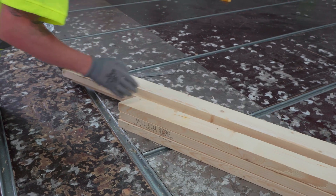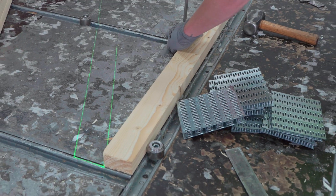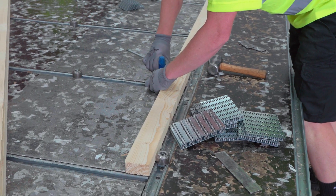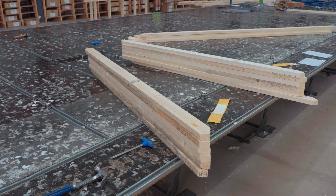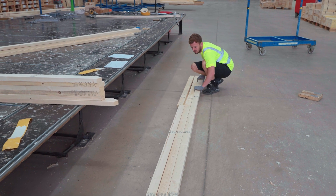You still want to make sure that once it's all together and you've laid the timbers down, you have a little measure just to be on the safe side, then fix everything securely using the chocks. He's laying out his timbers in preparation for building each of the trusses when the jig's set. What's the typical pitch for most truss roofs? Probably somewhere between 30 and 35 degrees through your standard set of fixes.